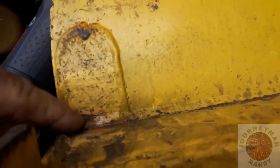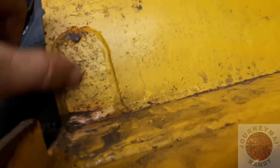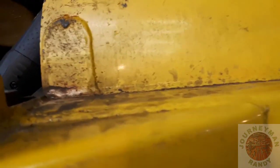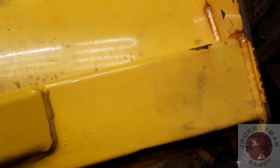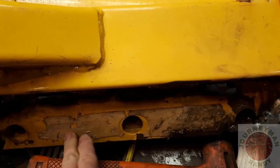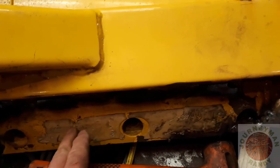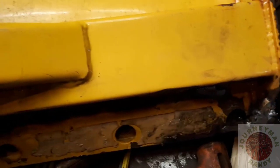This little piece is kind of an indicator — it's a weak point there. The other wing on the other side has the exact same crack; it's a little further in here and it's on the face of it too. This one here is only on this little tab that's been welded behind. There's no other way to make that stronger because it's got to slide in — it's got to clear the moldboard of the main part of the plow. I'm gonna go over it with a flap disc sanding disc and try to paint it. This stuff here is like some sort of hard plastic — I think it's a some sort of friction material, probably Teflon, that helps slide it over as it's traveling in or out.